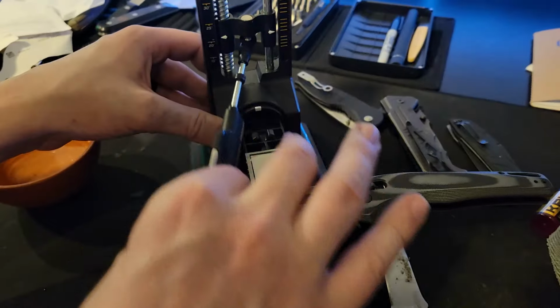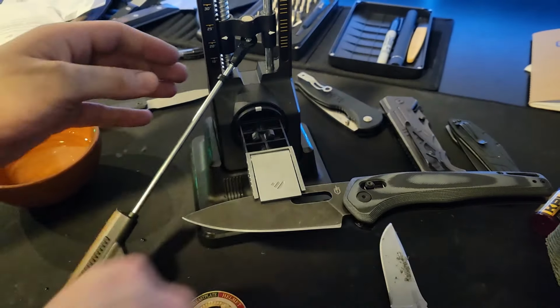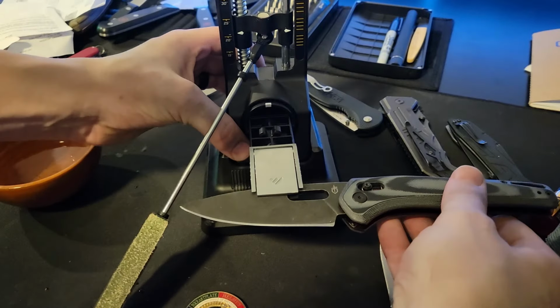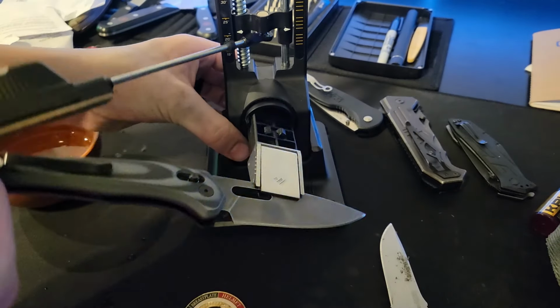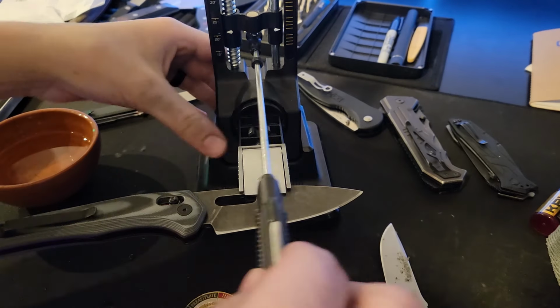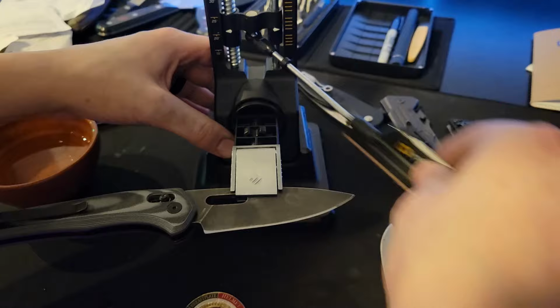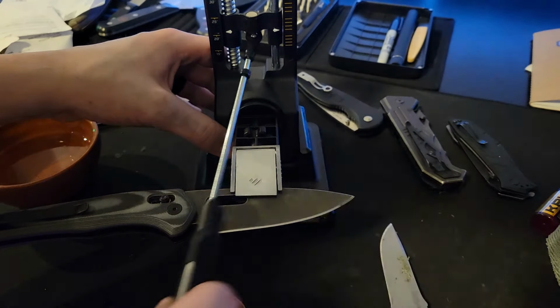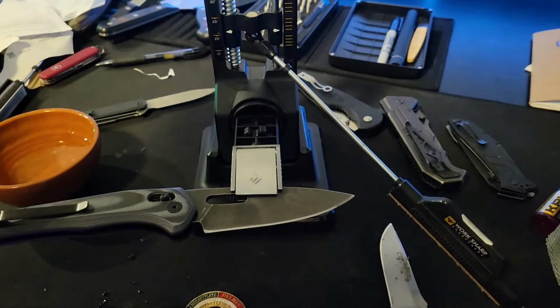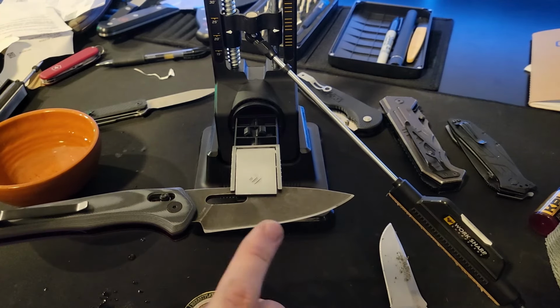There's still what's called a micro burr on the edge. No matter how good you are, there's going to be a micro burr. You watch the best knife sharpeners in the world. I specifically recommend going watching Terada Hiroyuki's video where he does stropping. He has like 5 different strops he runs every single knife through. Stropping is what helps get rid of that micro burr.